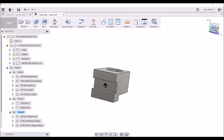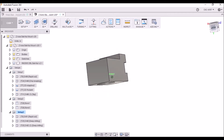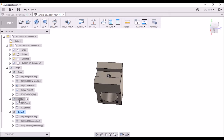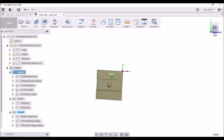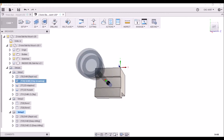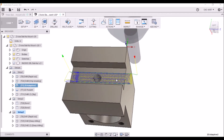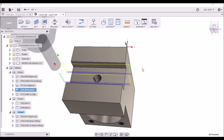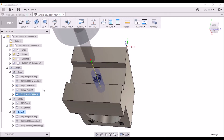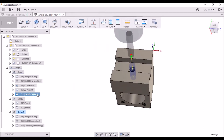So let's go over some of the G-code for this. I had to do this in two setups — well, I'm showing three here, but really it was only two setups. The first setup is like this, with the top left-hand corner as my zero. Center drill, then boring a hole through here, then come back in and doing some adaptive clearing to make the slot. A couple of finishing passes to get it to size, and then a tapping pass to thread it — this is M8 by 1.25.